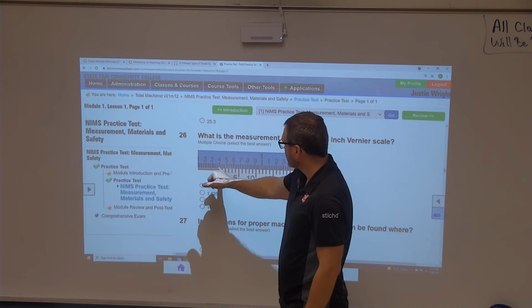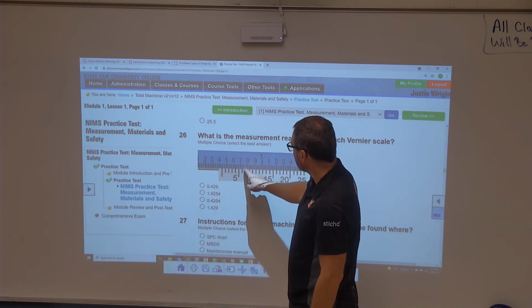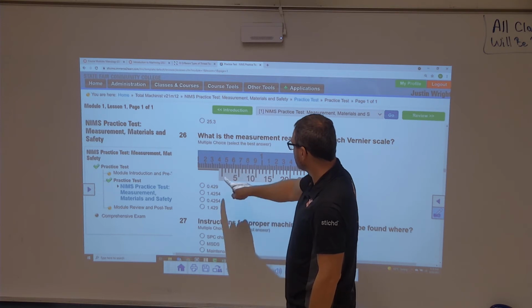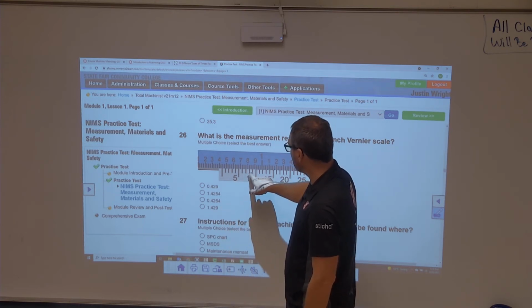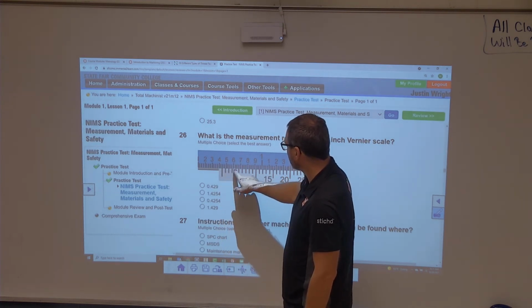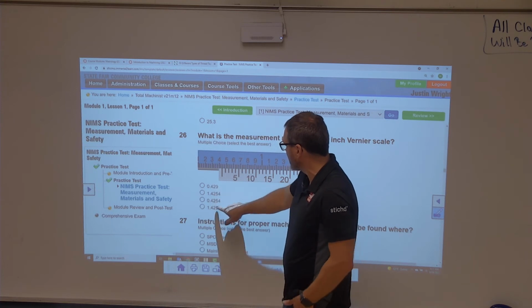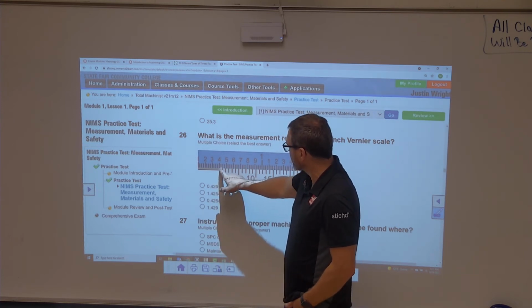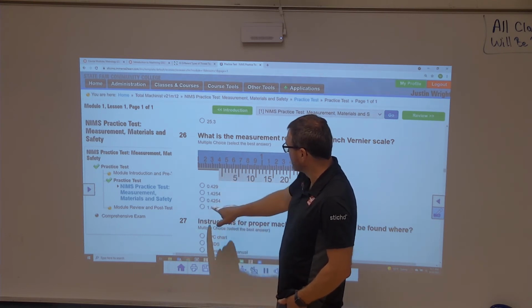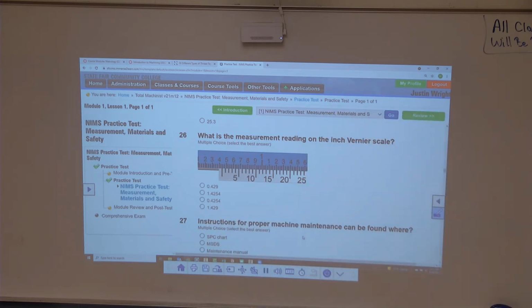Okay, so we're at 400, we're at 425, and then we've got an additional 6, 7, 8, 9, 10. We said 429, and that might even be my fault, just a little bit short of that. I actually might call it 425.4, not 429. On this 10th scale, so 400, 425, the line that lines up closest is this 4 right before the 5. So 425.4 on that one instead of 429.